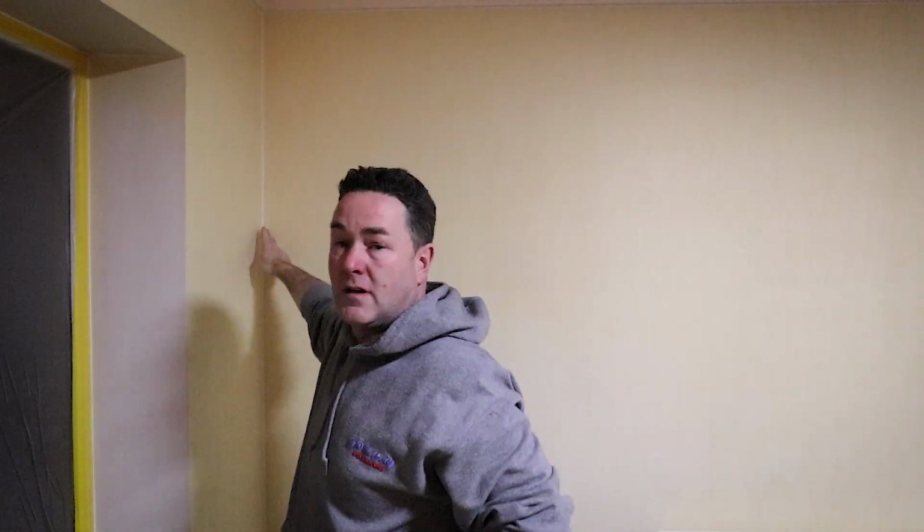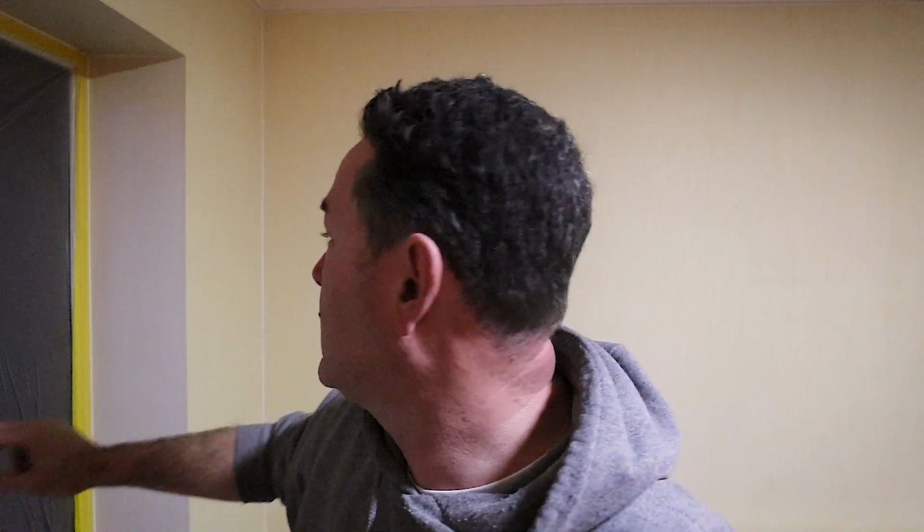I'm back. Right, you're going to say, why did I cork it? It was mainly just to neaten up the edges, because when you do an internal angle with wallpapering, you do a bit of an overlap, and I just wanted to try and hide that wallpaper edge in the corners. Top edge of the skirting, I've corked just to neaten it all off for when I come to tape it for painting the walls. Now, I've explained on the last videos, I'm keeping this wallpaper and we're going to be painting over it. I like this texture.